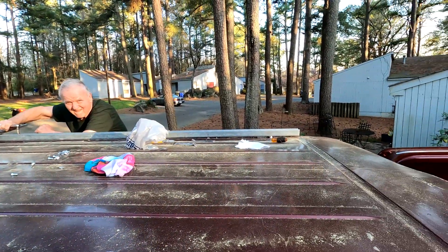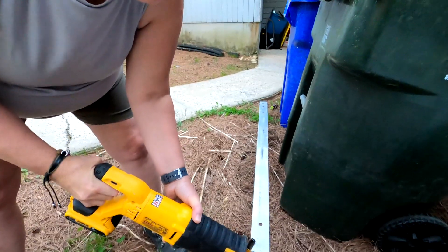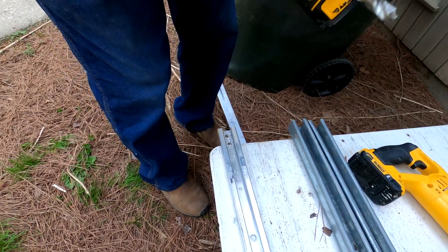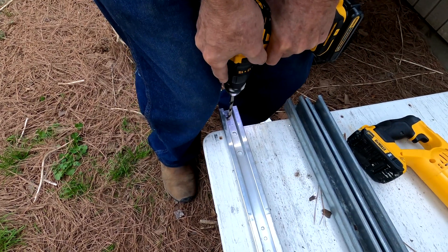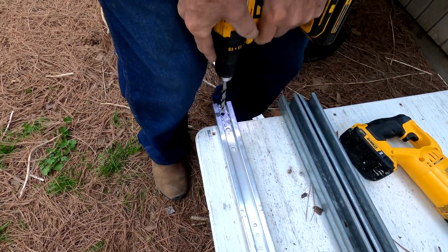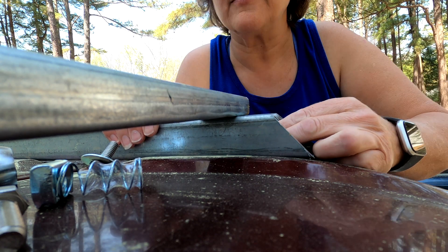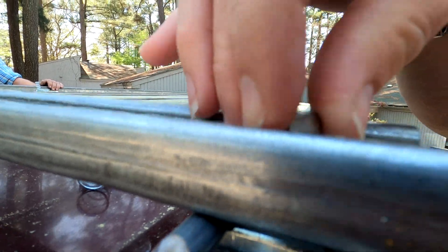Got our two side railings up. Put your nut on your unistrut nut, and then put it in from the end and push it over to the first hole. The washer goes on top, and then the nut goes in.